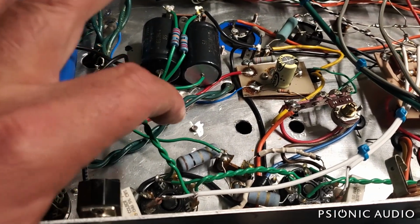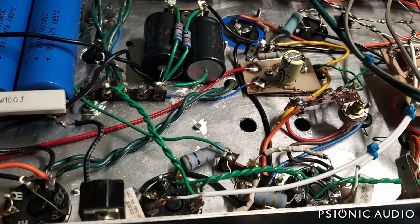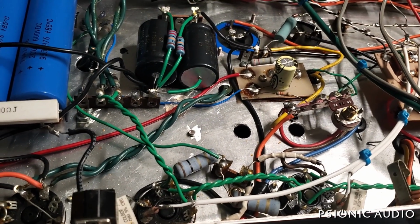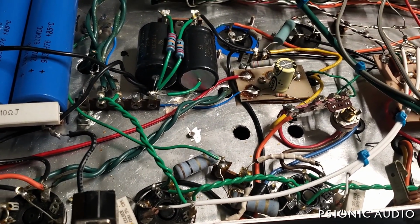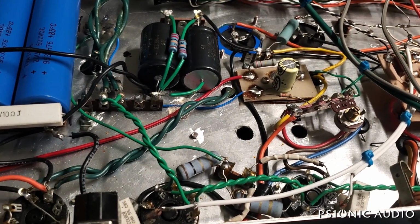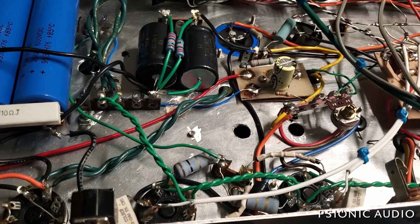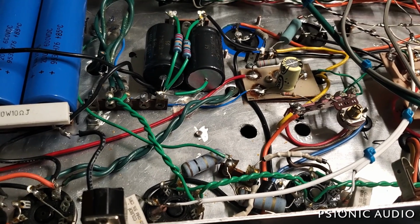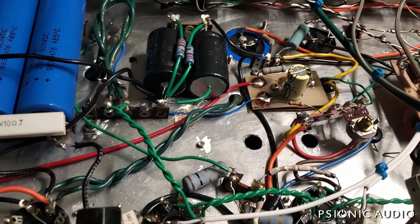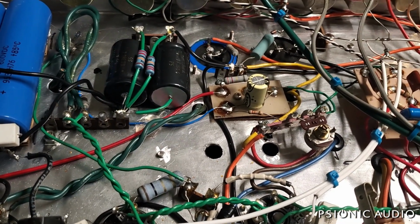It's got some honking big resistors from cathode to ground. I've not measured them yet to see if that's just like a 1 ohm for measuring bias or whether he's doing a partial cathode bias thing there. I'm sure someone's screaming at me that that's clearly a 1 ohm resistor or something. I'm red green colorblind, and I just pretty much ignore color bands on resistors because I cannot trust what my eyes say. I've got to measure them. And from a certain perspective, in the end, that's better.